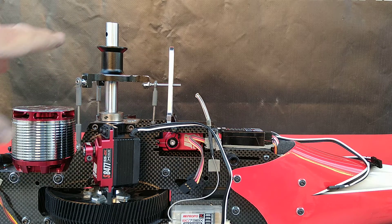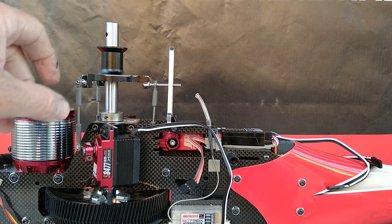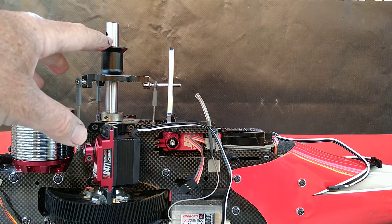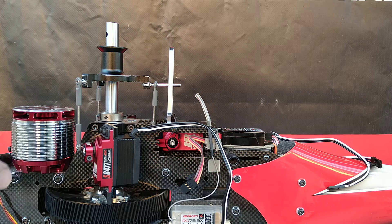It's very important that the slider is a good fit on the shaft and slides up and down very easily. If I disconnect these links, that slider will just drop on that shaft with no problem. It also has a little bit of tri-flow on it — Teflon in suspension — to make sure that it moves very easily as the servos sync up.